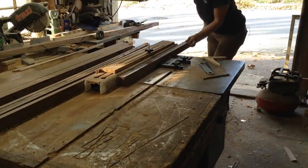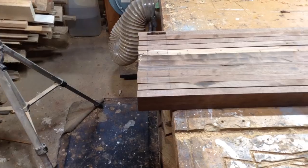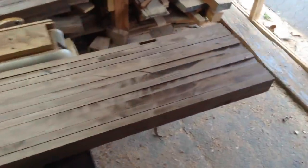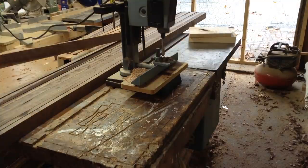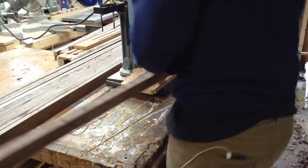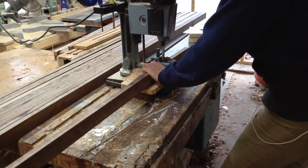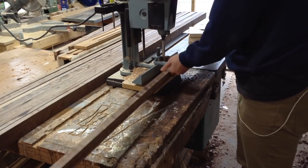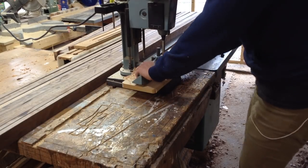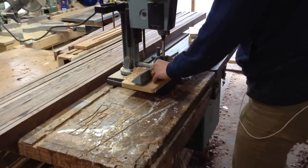You can see I really needed to sharpen my blade — there was a ton of burn marks. It would have been smart to do it before ripping everything down. Then I laid out all the mortises. There are only two joining pieces per section, as in the photo, and the customer wanted it close to what was shown. There's a piece at the bottom that designates where the first shelf starts and a piece at the top, which sits a little taller than the top shelf, so I left a slight overhang to trim down later.